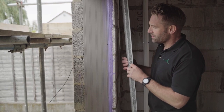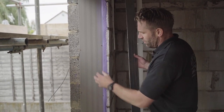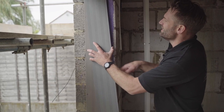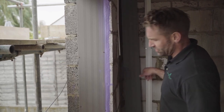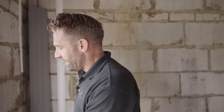The next area is cavity closers — these bits of plastic with insulation to assist with the cold bridging detail. These need to be sealed up with mastic or a product like passive purple to keep them airtight. That goes into the actual cavity and keeps a continuous air barrier around there. That's important — most builders just throw them in and leave them.